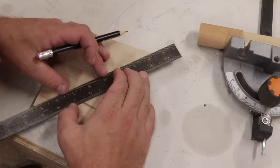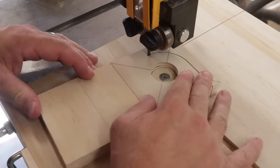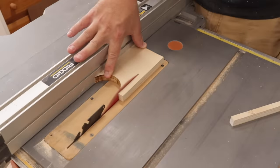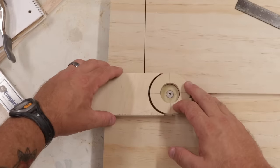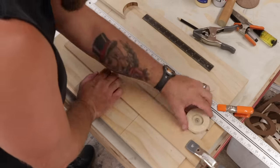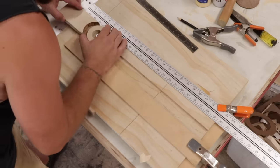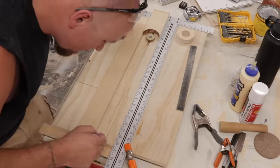The next step is to take a piece of scrap plywood, find the center, and drill an inch-and-five-eighths hole — the same size as the dowel. That's what we use to make the donut. I cut a pretty tight circle, then took the scrap piece left over, cut the top half off, and trimmed the side down to just the upper arc of the circle. I set the adjustment knob close to the tightest circle I'd probably be making. This piece serves a couple purposes: it's the zero-clearance fence for the jig to eliminate or partially eliminate tear out, and it acts as a stop so the adjustment knob can't go too far down. I'm using double-sided tape to fasten it so I can easily replace it as the saw blade wears it out. I then made sure the donut could pass through its track perfectly.